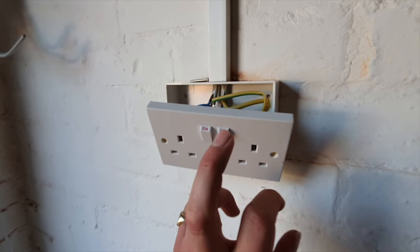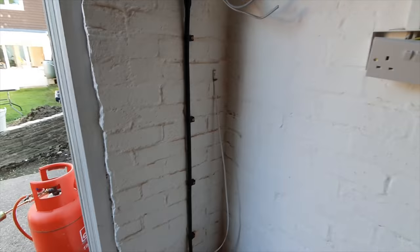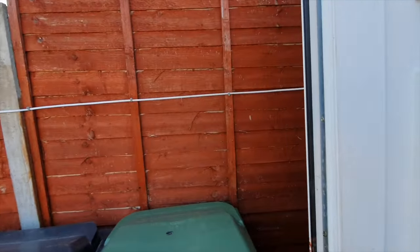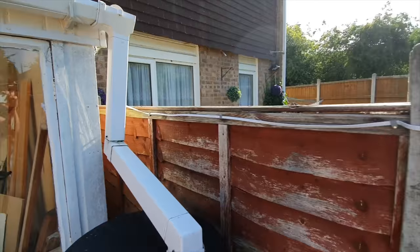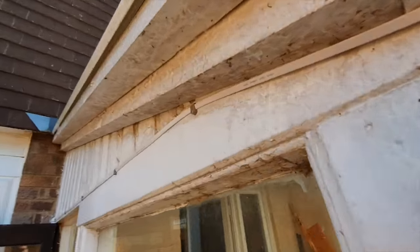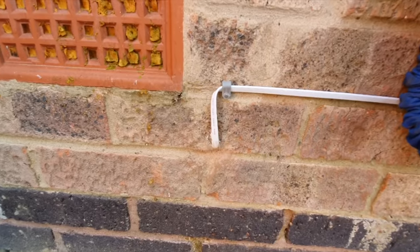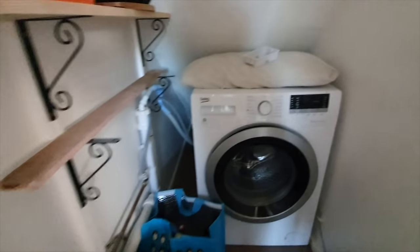Tomorrow he's got to come back, connect up all these little bits and pieces, set up the fuse, line up the switch, and also do the stuff at the front. What I've been doing with my time today, besides clearing up his mess, is I've run an ethernet cable through the same hole. I was originally planning on running it underground, but I thought it's probably going to be better to run it over. I've secured it all the way along the fence, run it up at this corner, and attached it underneath the guttering — so it's quite sneaky and subtle. I've then run it along the top of the lean-to, down behind the door, and into the wall. It comes through where the waste pipe is for the washing machine, runs all the way behind the washing machine, and comes out just next to the router.